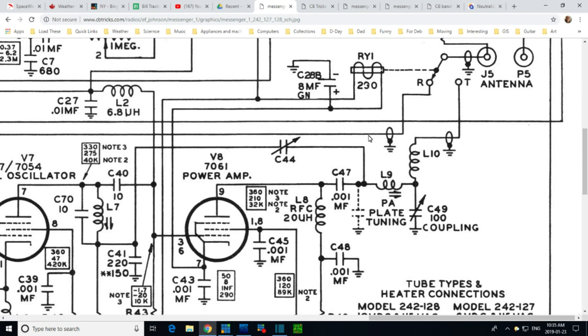So how do you get the swing happening? You tune this to 27 MHz. You then have the input signal coming from the oscillator also at 27 MHz. So you have the bumps — the shoves — coming out and running into the swing and shoving it. If this is tuned to the same frequency, I think this is a crystal-controlled oscillator over here, then you'll have an easy time pushing the kid on the swing.